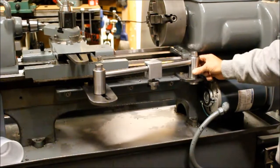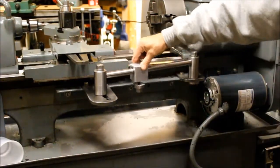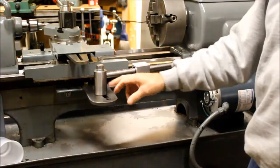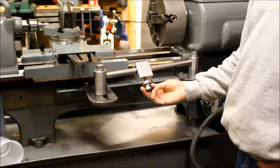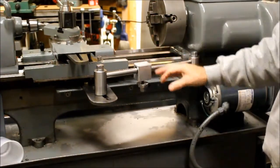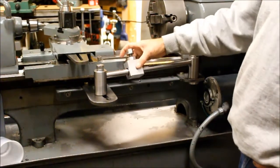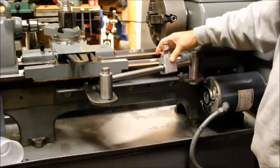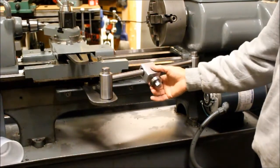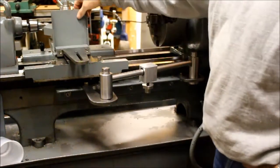The pillars are about an inch and a half in diameter. I have a three-quarter inch draw bar — it's three-quarter inch drill rod — that spans between the two centers. You could use one inch; I certainly wouldn't go any thinner than three-quarters of an inch. On the draw bar I have the bushing — it's a bronze bushing pressed into a block of aluminum — and that is what gets attached to this part right here.